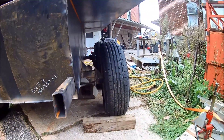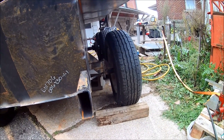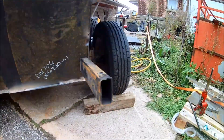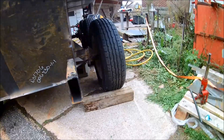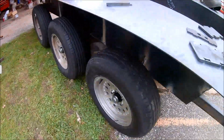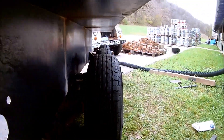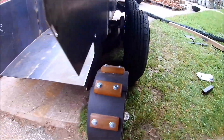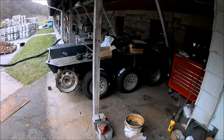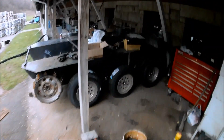If the camber becomes an issue I'll have to cut it apart and tap it back down, but as it stands I'm just gonna leave it as-is — we'll see how resilient the system is to human error. Overall everything lined up pretty good; wheels lined up good. We'll have to see how the sprocket lines up with the differential once the axle is installed.